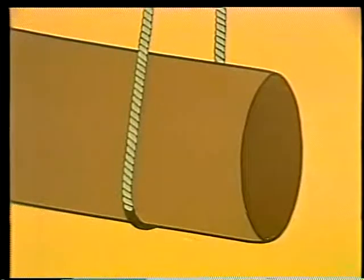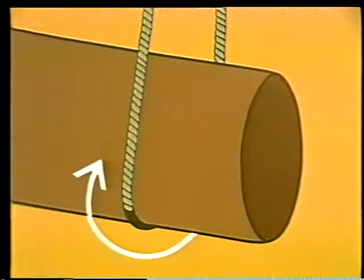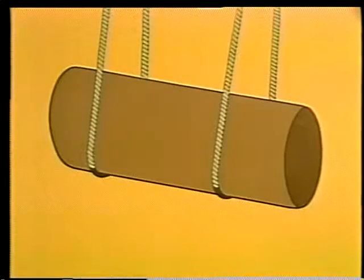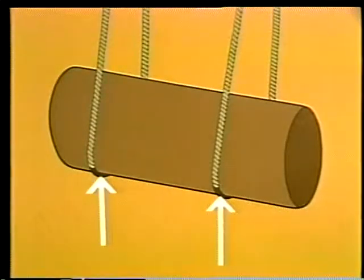This hitch is called a basket. The sling passes around the bottom of the load, and both eyes are connected to the load hook at the top. Like chokers, basket hitches are often used in pairs. That way, a load is supported at 2 ends instead of at a single point.